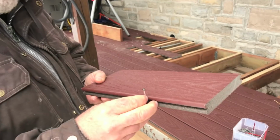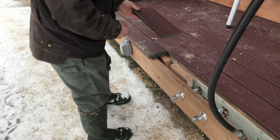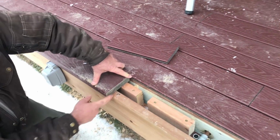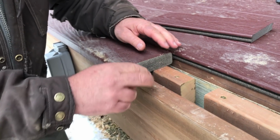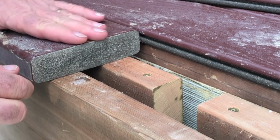So this is what holds the boards down in most places, but it can't hold them down everywhere. The outer pieces, for example. The outer pieces, exactly. And in this case, this outer board is actually quite a bit thicker than the main board. Oh, so yeah, that's like a full 1.5 inches, it looks like. It's 1 3/8 in this case, actually, but I had to make this a different height than what supports that so that the top lines up.